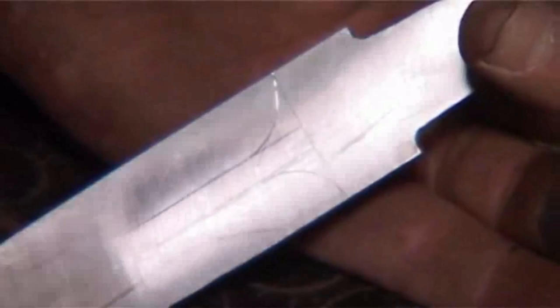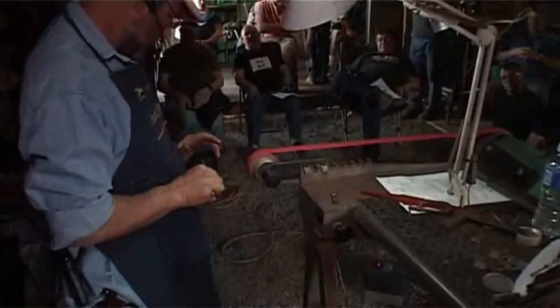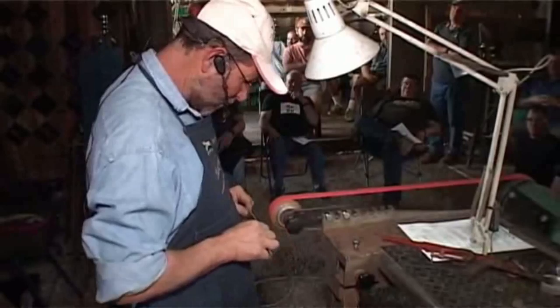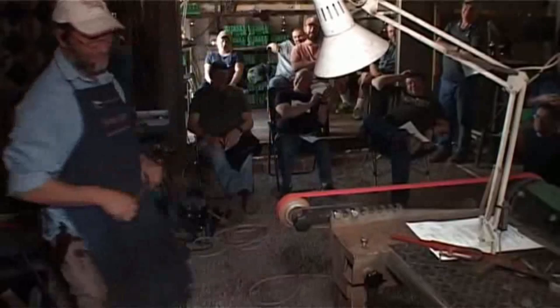All right, so as with any grinding, your grinding stance is important. I like to stand in front of the machine with my forearms and wrists against my stomach. Typically, I would want the center height of the belt, or the wheel, to be about navel high. Okay, so I'm going to apply pressure to the belt and sway my body. I move my body left to right. From behind, it's this kind of motion. Kind of looks sexy. Okay, you sway like that. You're not moving your arms left to right, you're moving your body.